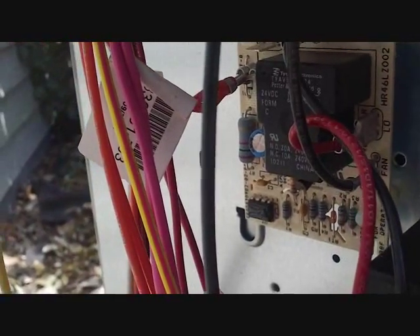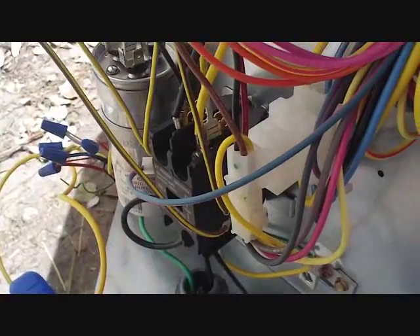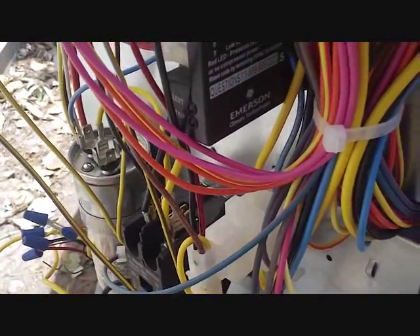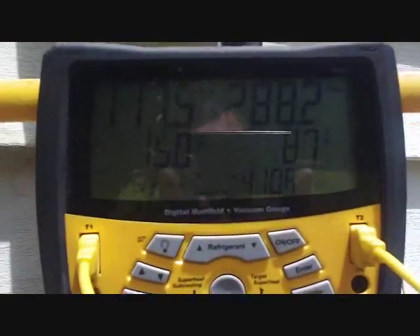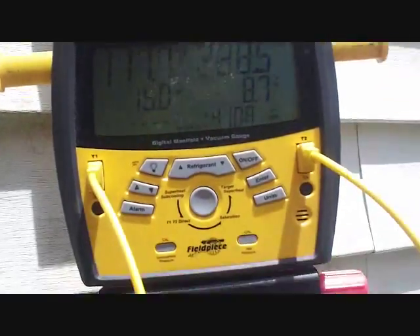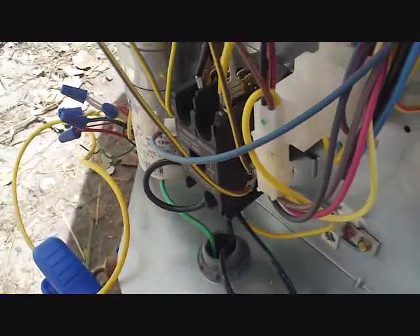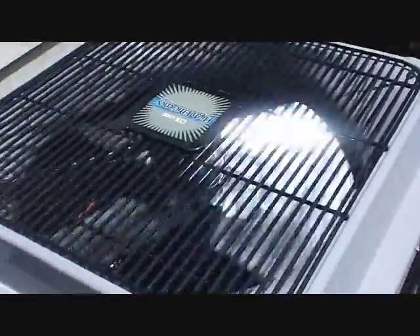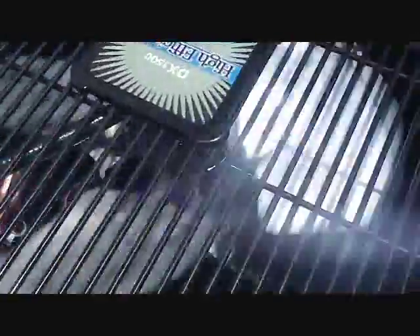Another look at the controls. What you do on the high-end is unplug the yellow and brown fan wire going to the 24-volt AC terminal at the top — that means the fan will run at high speed constantly, which is what we want when charging to get a proper sub-cooling reading. If the fan slows down, the sub-cooling goes down too and gives you a false reading. Right now we're at 8.7 degrees sub-cooling and we're looking for a target of 12. Superheat looks good and it's staying pretty low. This is a 3.5-ton — the one we did yesterday was 2.5 tons. Very nice.